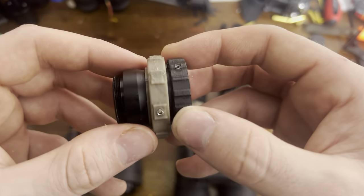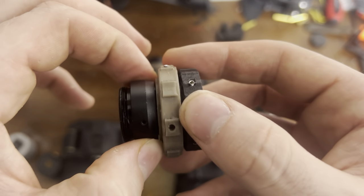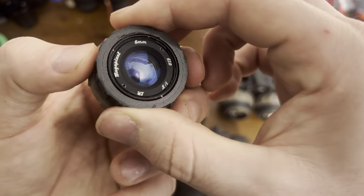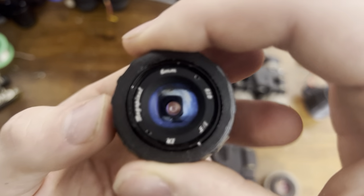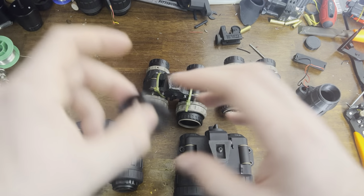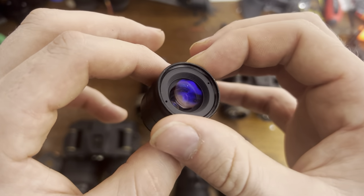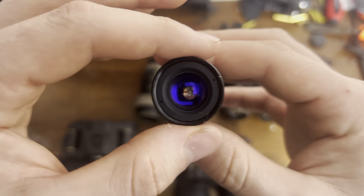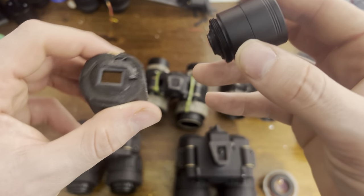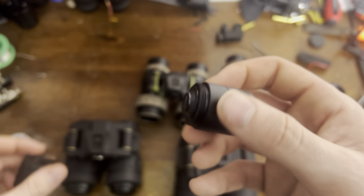But for the digital, you'll need the digital objective lens. This one right here is discontinued, but I have it, and it's the one that works the best. Not the best, but it works. I like the way it works. This one right here is what we're switching to. This is an 8mm focal length f1.0 CS mount lens for a 1/3 sensor size. So it's just the right lens for this sensor size, essentially.